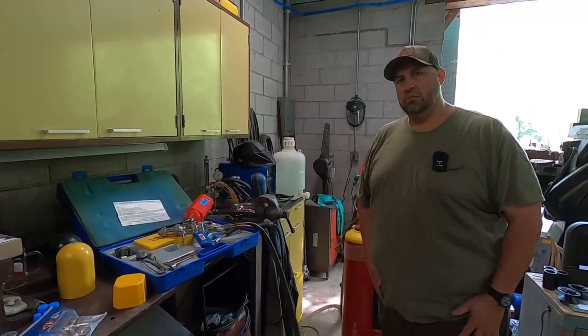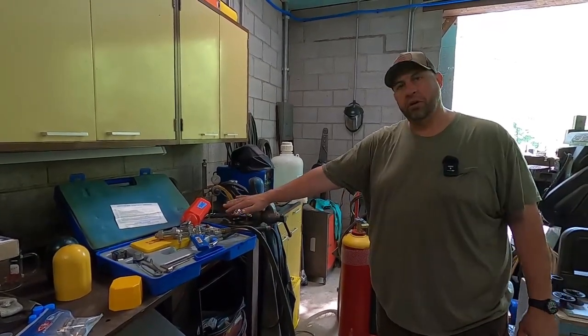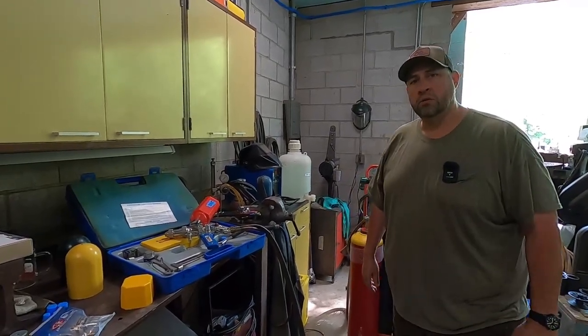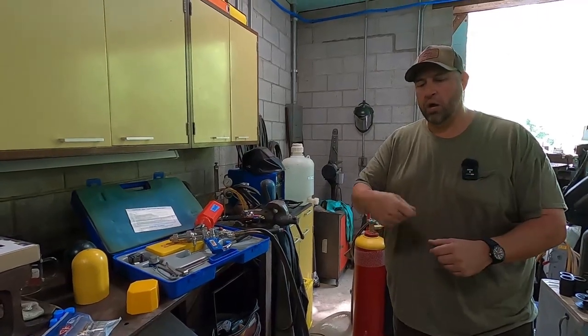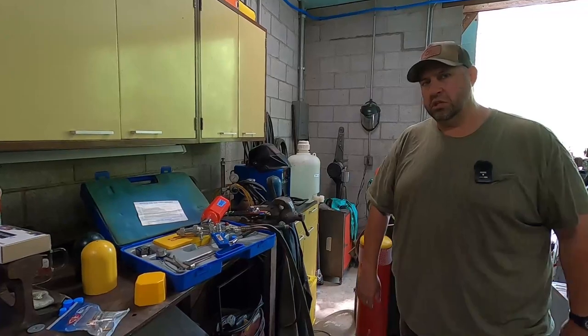I didn't think about that, but that's true, I'm sure. You set your shaft up, you get it running true, do your undercut, spray it with this, let it cool, turn it to size, and you're pretty well done. So it will save hours of jobs doing it a different way, where you're going to weld it up with an arc welder or machine it and have to put sleeves or something on it.